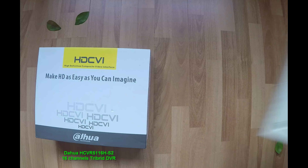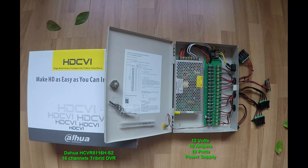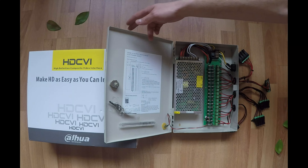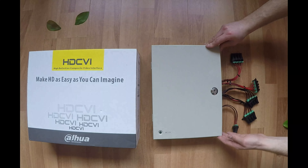First, a 16-channels DVR, a 12 volts 10 amperes 18-port power supply. This is enough to power up all 16 channels of the DVR and you will still have two empty ports. They can be used to power up the DVR itself. Each channel has a fuse for overcurrent circuit protection.